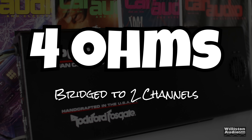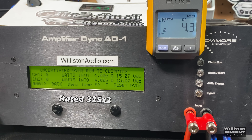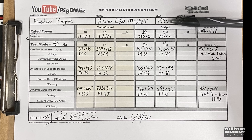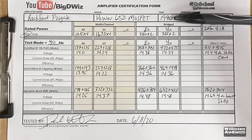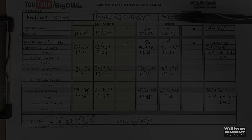Next up we're going to bridge the amp down to two channels and do the four-ohm test — this is what a lot of people did back in the day with subwoofers. Rated 325 by two, and as you can see, certified 472, 475 — quite a bit more than rated power. Uncertified, right about the same: 470 watts per channel. I did notice an anomaly in the dynamic power mode — one channel almost 700 watts (692) and the other one 425. Not really sure if that's an issue of one of the caps or something, but it is interesting to note, though I could not tell when I listened to it with speakers. You can pause this to see the full results of the amp dyno sheet. We also tested 1 kHz and it did over 500 watts per channel.